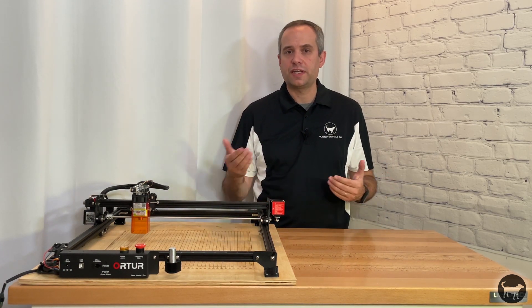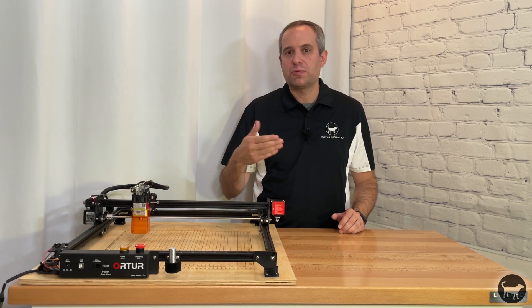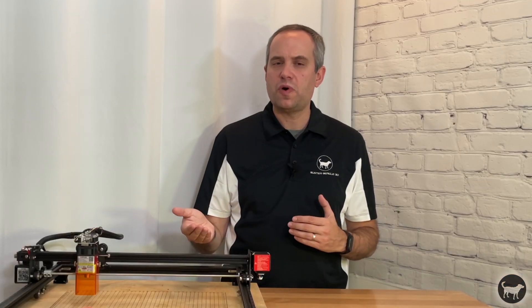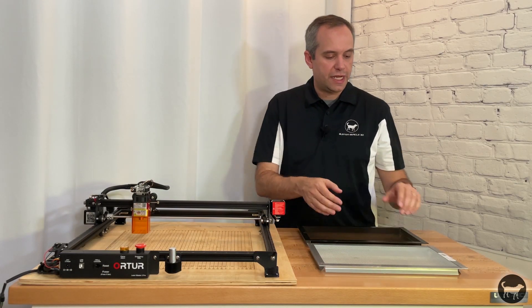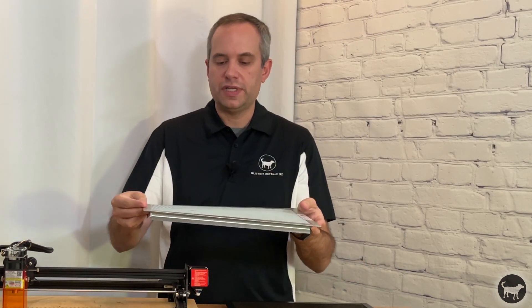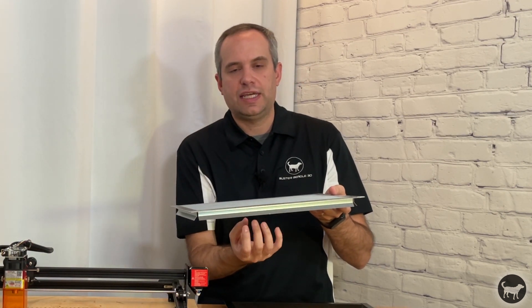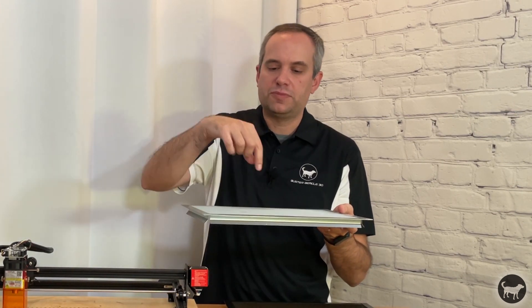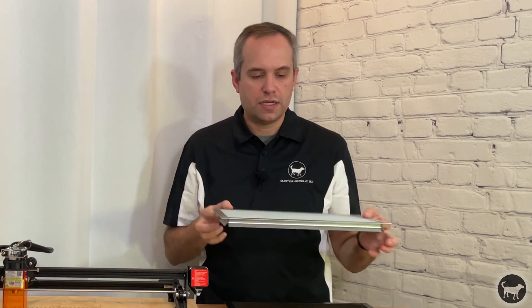The last modification I wanted to try was lifting the piece off the spoil board surface during a full cut to prevent the back side from charring too badly. I also wanted to see if this would improve overall cutting power by having that separation. What I did was go to Home Depot and buy what I think is a grate cover for an AC unit — it has a metal pattern that leaves space between the surface you're cutting and the bottom, so when the laser goes through, it's not running out of oxygen and the piece doesn't catch fire or char on the underside.